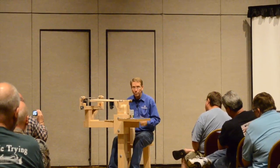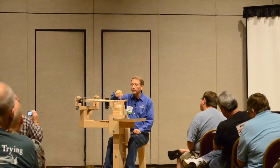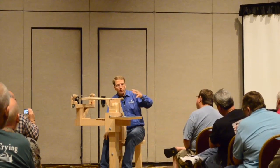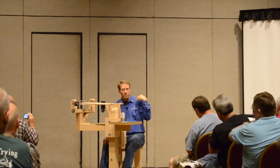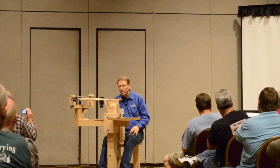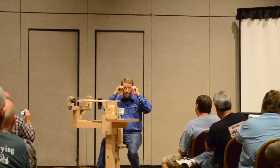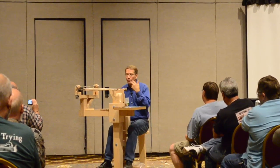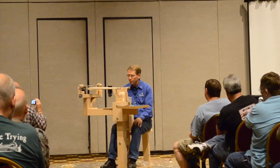The real problem with this room and this tool is that the lights are up there and I'm looking down on a blade and a line and I can't see anything. I really want to have a window or a light source coming over my left shoulder if I'm right-handed — that would illuminate the blade perfectly. I also wear an optivisor with a number 4 lens which gives me double power at 10 inches, and it really helps a lot to see what you're doing when you're cutting.